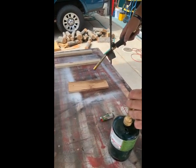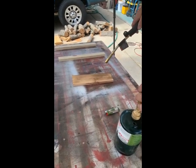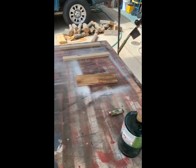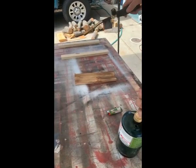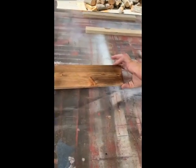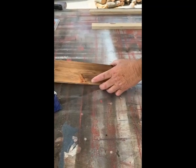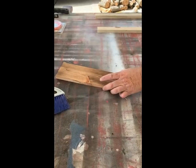Just nice and even over the top of the wood and you'll see the burn pattern. You just burn into the pattern that you want. You don't have to burn heavy — just a little. This is just a light technique. On the cedar you can see how it just burns nice and brings out the grain of the wood. You can see that grain just coming out, and you can see where the knots come out. Sometimes you'll get a little bit of sap coming out of those knots, and that's fine.